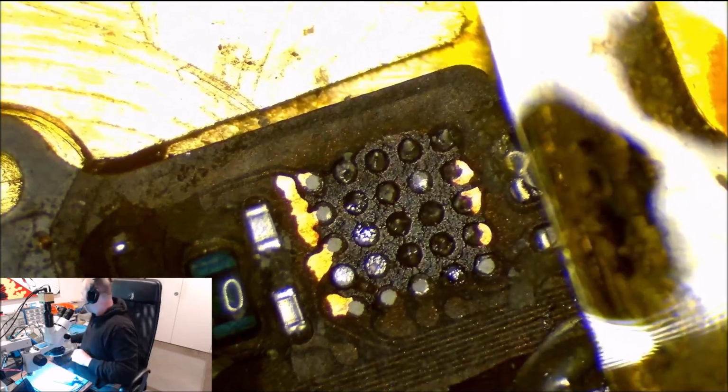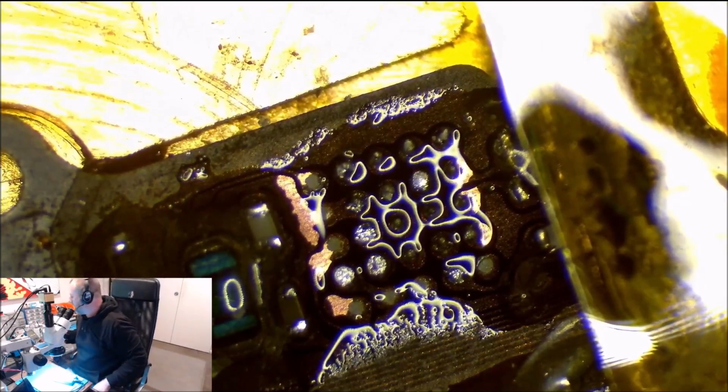See how that solder that's there is going to touch that? So what I could do is go around with the UV cure, but I won't bother. So let's get our mini JBC needle on, which is not plugged in. And we're just going to literally touch those with what's left on there. We're going to try and utilize what solder is there at the moment. So like that, just like that. See how I'm taking a bit from, see how that joined?